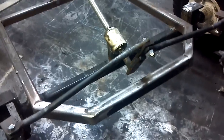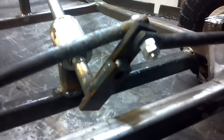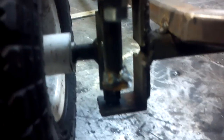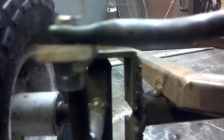Originally I decided to go with the bar-down design instead of going up. The problem with it going down was that because the pegs were forward, when you turned the wheel to the right the pegs actually went to the left, so the steering was lopsided. What I ended up having to do — as you can see, I welded these pieces just underneath the frame — but the problem was the same reversed steering issue. So I made a little extension piece here, welded on a flat bar, and double-nutted a bolt for a good hinge.